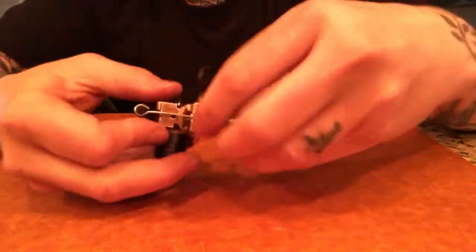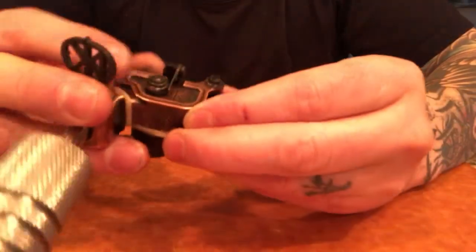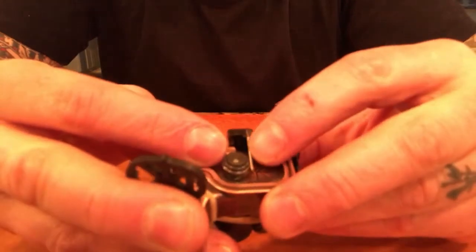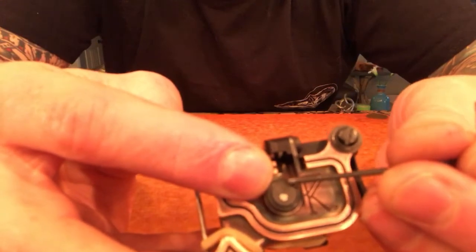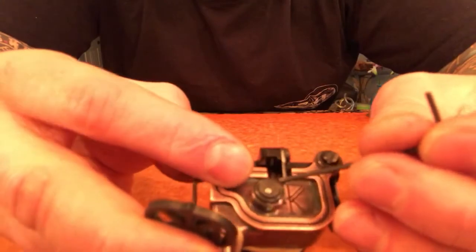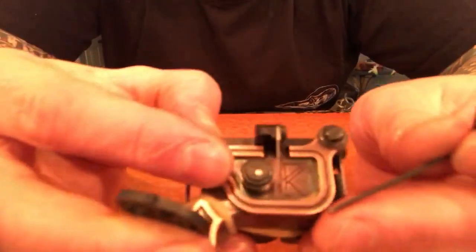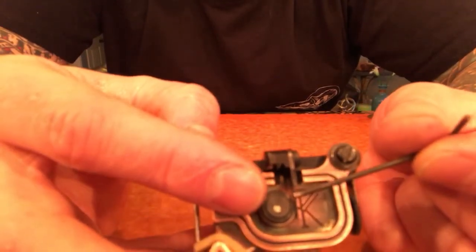Now, the most important part of tuning that is often overlooked is setting the impact screw. Right out of the gate, you should never have to mess with the impact screw — I set that at the factory — but just to double-check: you'll see I put a line on the cam. There's a bearing on the cam and also a line on the frame. Basically, you push the armature bar down, roll the cam over to it so it just gently touches the spring, and those lines should match up.